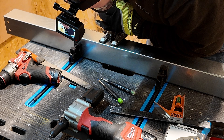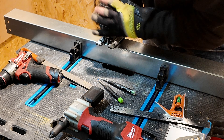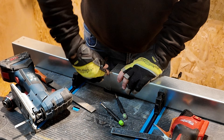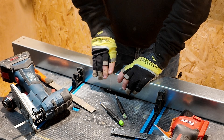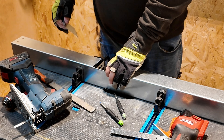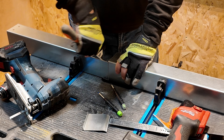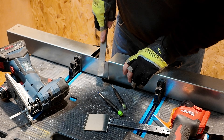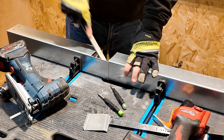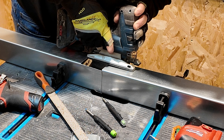You can see here we're making that final cut across the trunking and we can get on to doing a little bit of filing and remove some of the metal we've cut. On this one we want to file the back edge of the trunking so we can snap that away to give a nice clean cut — though in hindsight I didn't file that for quite long enough and it hasn't come off as easily as it could have done. But the result is still acceptable — a nice neat sharp line. Whatever method you use to make your cuts, you will be left with sharp edges and you need to smooth and deburr them, and file any edges and angles to a flat or rounded angle.